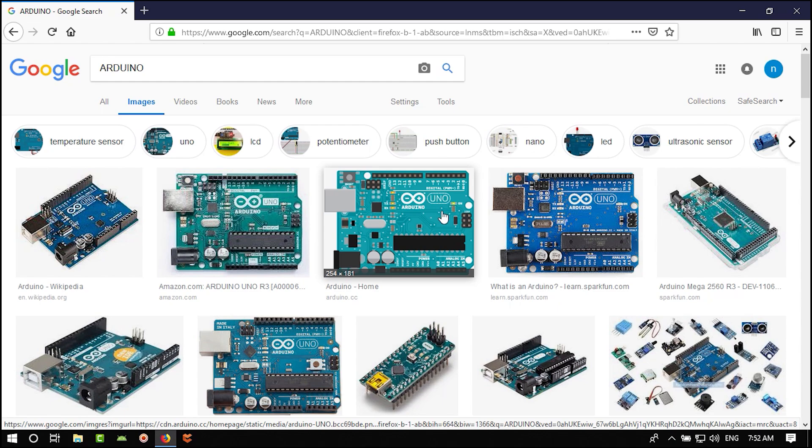What is a bootloader? For simplicity, to program Arduino there is a bootloader that lets you program the microcontroller with something like this IC — a USB-to-TTL or USB-to-UART converter. That's all Arduino is: a bootloader on a microcontroller that lets you program it with a USB-to-UART converter.